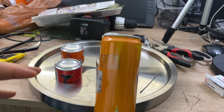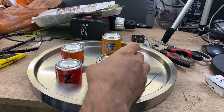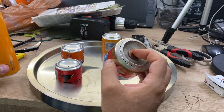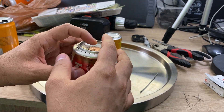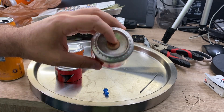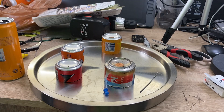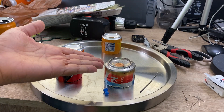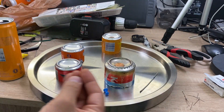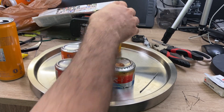So I told myself, instead of making the pulse jet engine right away, I'm going to make a burner that basically burns off the outer and inner coating. After that we have a can where all the coatings are gone, so we can use it in the pulse jet engine and it will not produce any bad smell. I made the design of the burner. As the heat source, I wanted to use one of these penny can alcohol stoves. Many years ago — 12 to 13 years ago — I watched a YouTube video and followed the instructions to make this stove. I found it in my storage room, turned it on, and wanted to use it in this burner, but the problem is it produces a very large flame, and the flame is orange and yellow, so I didn't like it and made another one.